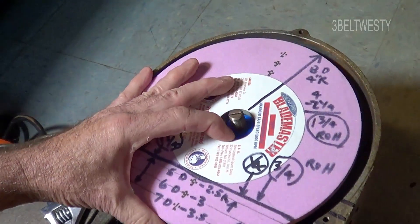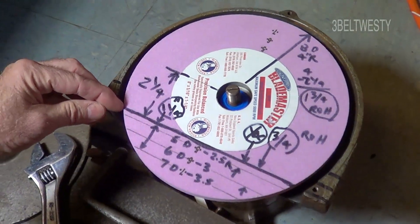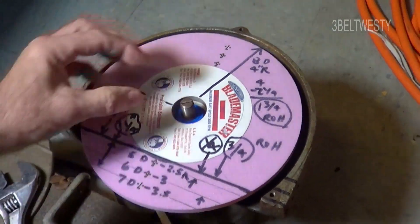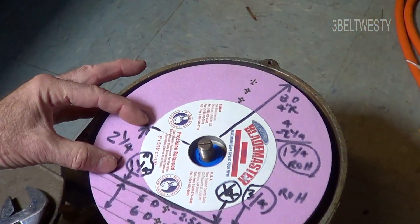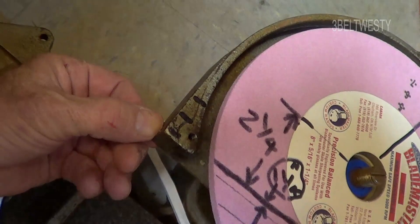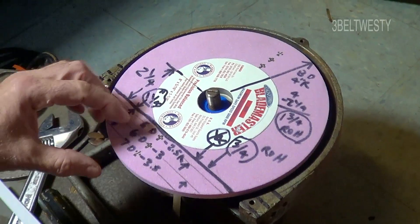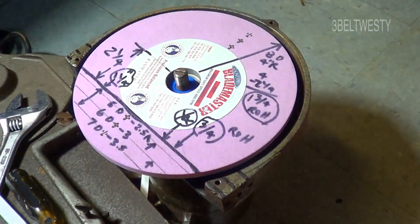On the S8, I've drawn this on an 8-inch disc to explain: the pivot point farthest from the center is two and a quarter inches from the centerline of the motor hub. For a brand new 8-inch disc, the radius is 4 inches. Subtract two and a quarter and you get one and three-fourths — that's the minimum radius of curvature. Whatever arm device you use, that pivot location determines the radius.